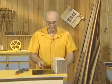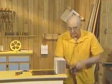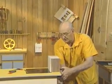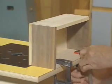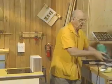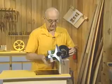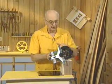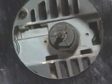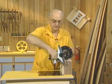Well, there's a couple of things we have to do. I want to clamp that box into place so it doesn't move around, and we're going to use a portable router for it. So we'll pop this in here like this. Now we're going to use this portable router, and I've chucked up a 1/4-inch bit in it. I'll just pop this back in here so you can have a look at it. It's a standard 1/4-inch bit, exactly 1/4 wide. It's a spiral bit. What I'm going to do is plunge and then move the router along the operation, and it'll be held by this. This is the fence. Now we'll tighten that up in here.